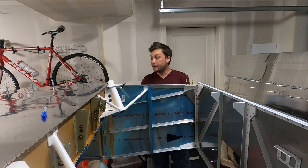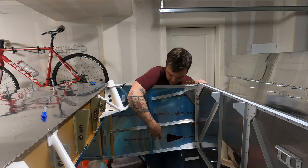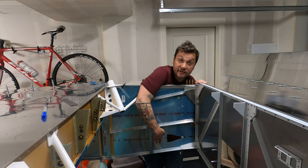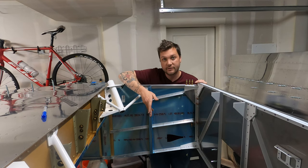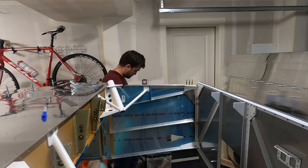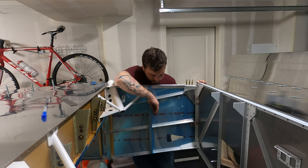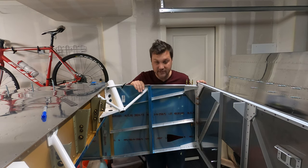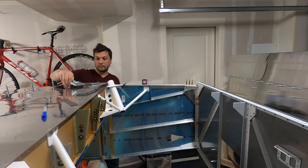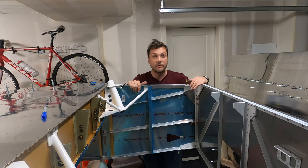It fits pretty good, but I can tell just by looking at my holes that down here where we get some curvature to this flange — like always — it's causing a bend in the other direction, 90 degrees to that curve. So it needs a little bit of fluting. We also need to make sure that the forward face of this is perpendicular to our skin here, and it's not — it's tilted slightly backward. So we'll grab our seamers and bend that flange closer to 90 degrees. I think with those two adjustments this one's perfect, then we'll move to the other one and keep marching forward.